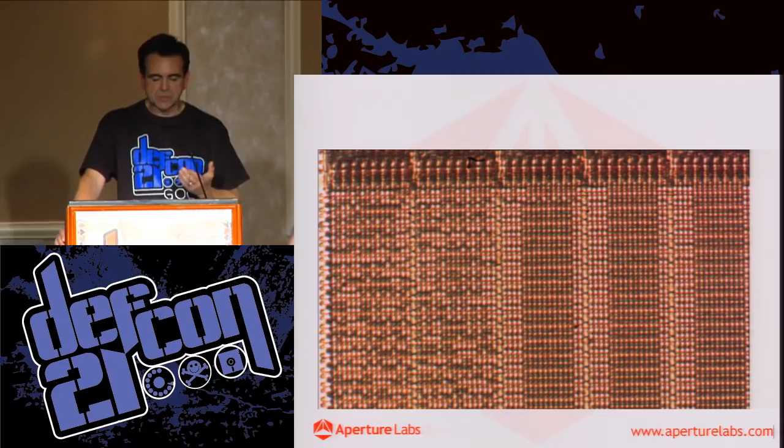So they used pattern recognition. They would take a picture of an OR gate and say, right, that's an OR gate, find all the other OR gates. Here's an AND gate, find all the other AND gates. And they packaged it up into this cool bit of software, which will then spit out a graphic representation of what that logic circuit is doing. Fantastic. That's going to be easy then. I'll just point that code at this, and we'll read the mass ROM, and then we've got the code.